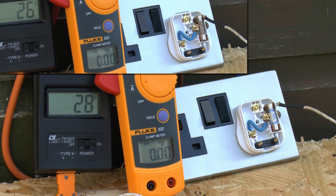This time I've got both setups again — the genuine 13 amp at the top and the fake 15 amp one at the bottom. The current this time will be around 30 amps, a considerable overload: well over double the rating of the 13 amp fuse and around double the claimed 15 amp rating if that can be believed. Let's switch on and see what happens. Switching on — it's around 30 amps straight away, and the lower fake 15 amp fuse has already failed, while the genuine 13 amp one at the top is still going. Again, rather inconsistent.